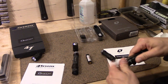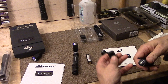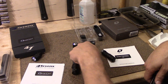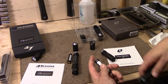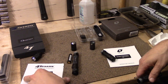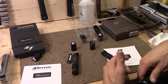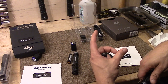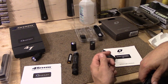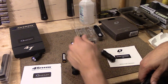The big danger — and you guys probably know this, but since this is going out to the general internet, I do want to say — don't stack two of these, or two CR123 batteries, and try to power one of these heads that has a 4.2V max voltage, because you'll be running at 6 volts with a pair of CR123s, or 8.4 volts with a pair of lithium rechargeables. That's going to be overvoltage for these heads.